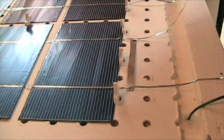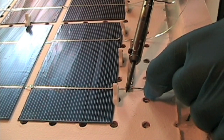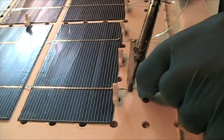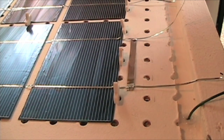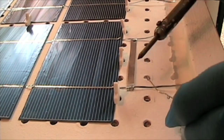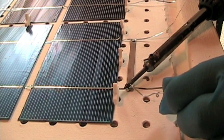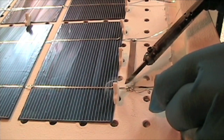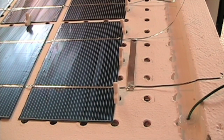It's basically knowing what part of the iron you can usually get a quick amount of heat from to activate the solder. I'm going to take some more solder here — I just like to have it nice and flat, not too bulky. There we go. I'm just going to trim off the excess tab wire and we'll be done with this positive connection here.